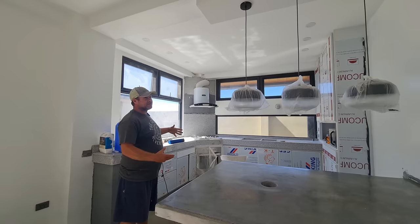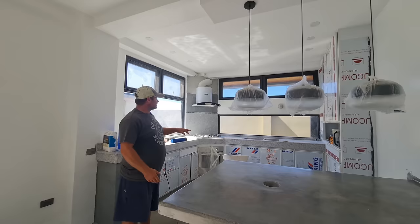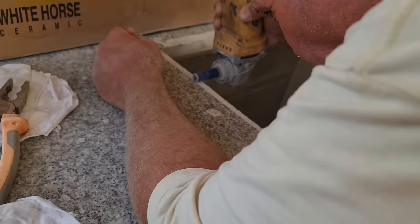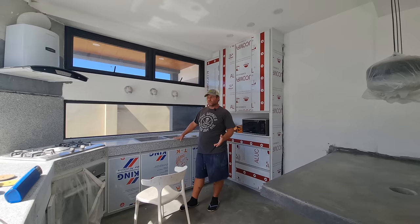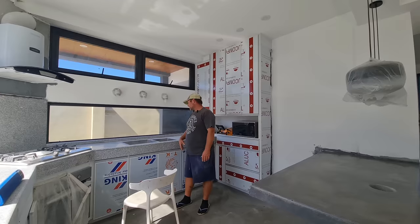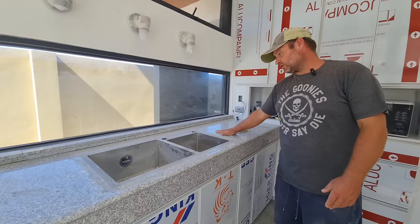We've got a two-burner stove on top — we found four burners was a waste because you clean too many burners. Then we've got the oven set in and built in on the bottom. It has granite countertops throughout. We didn't want tile on the kitchen surface, and everything was custom with a bull nose that I carved and polished myself. Part of today's process is repolishing the granite — starting at about 800 grit, working up to 5,000, then giving the granite a new polish and shine. We've also got a double basin stainless steel sink with a built-in soap dispenser and single faucet, completely flush with the surface of the granite.